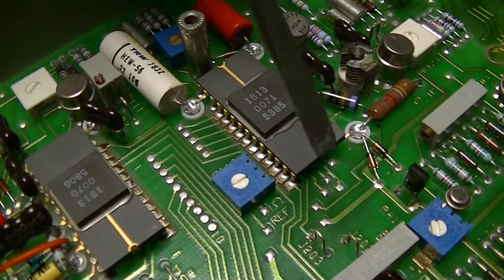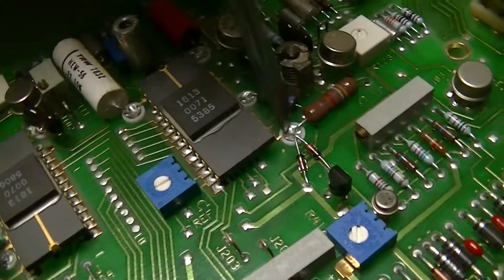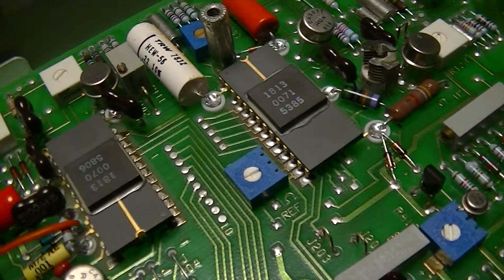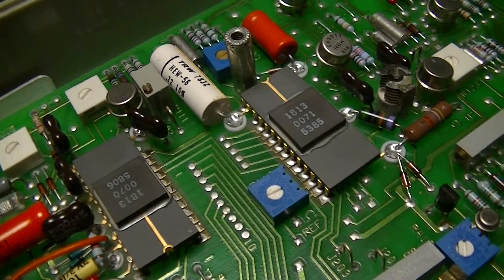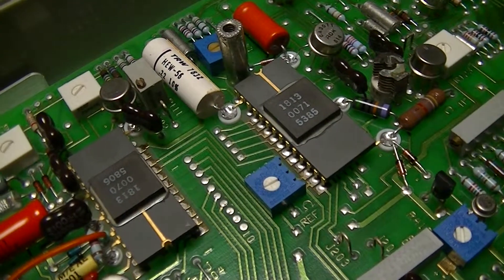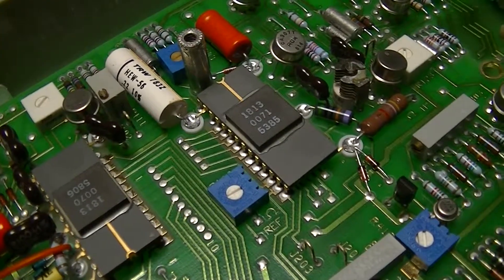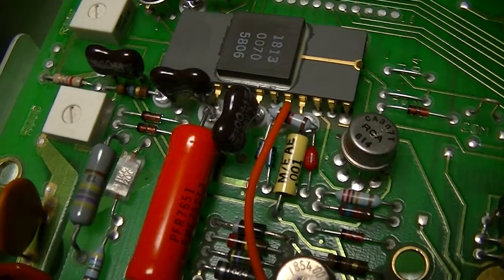One interesting thing to note is that a lot of the connections on this board use these plastic inserts where a bunch of devices are inserted into a solder cup which is then filled with solder. I'm guessing those are very high impedance connections where the board itself had too low of an impedance. I'm not exactly familiar with circuit design practices from that era, but I'm guessing those are probably for impedance purposes.